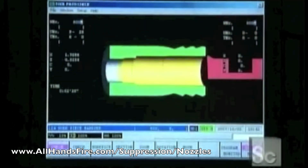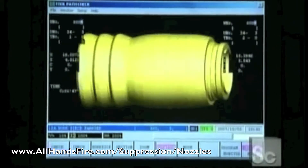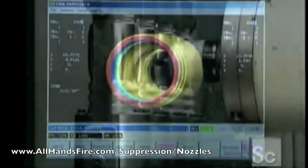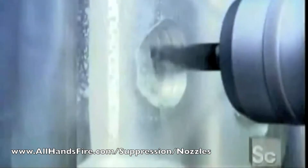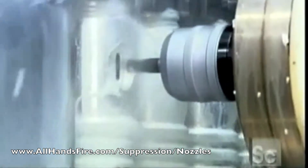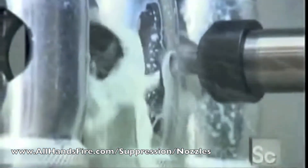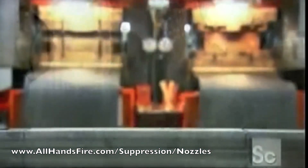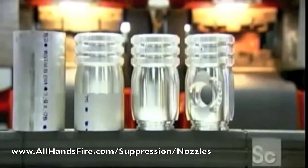Next, they form the interior. Technicians verify the inside shaping with computer imaging software. It's on to the milling process — a computer-guided drill bores several holes for the nozzle and grip attachments. Coolant washes away the metal chips and keeps the drill bit from overheating. The transformation from a blank to a valve body is structurally complete.